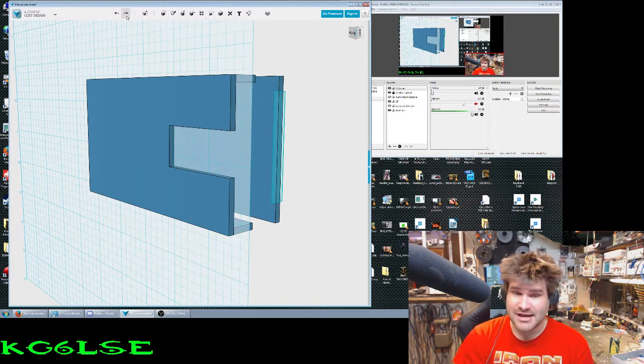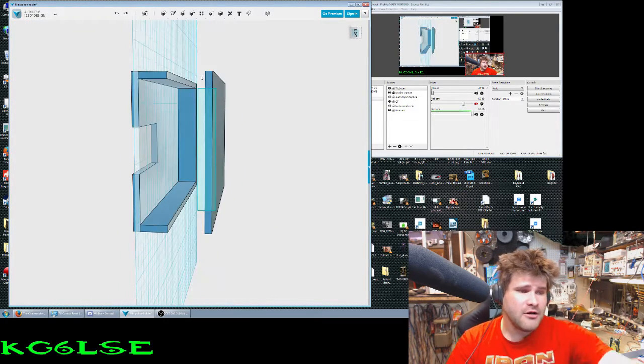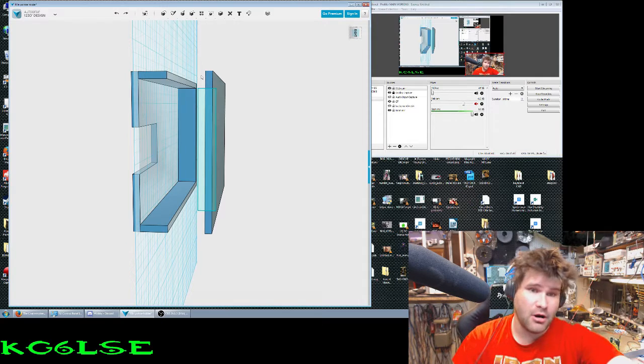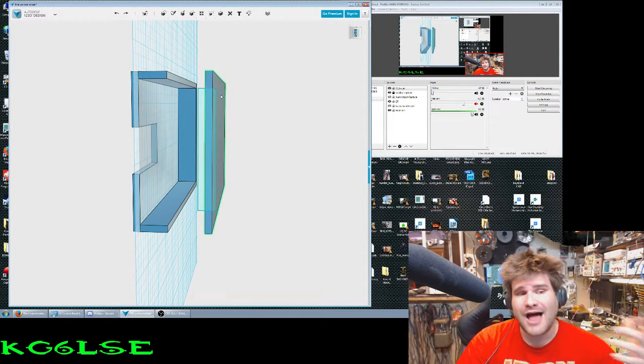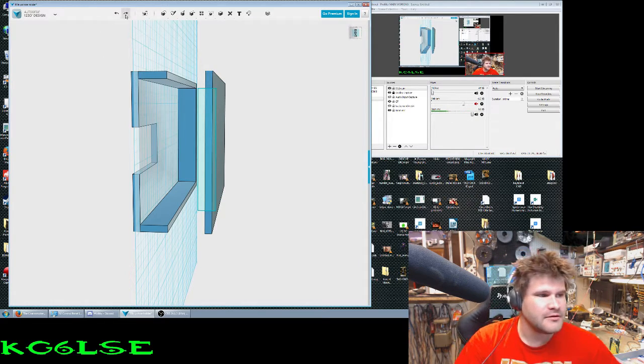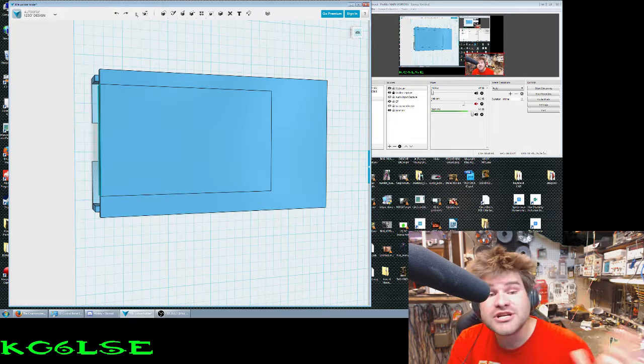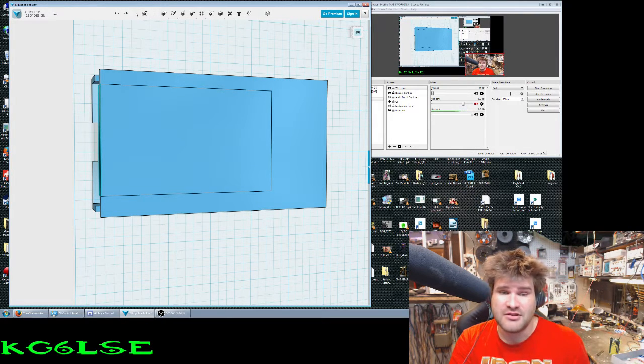And then at that point in time, you can use your calipers to figure out how big the screen's going to be. Again, make it a little wider than the print is thick for this one part in the print right here. This way it allows you to just bring the whole thing out. Just eat it out. Then you'll extrude to the size of your screen, but origin it to the top. Your screen might not be at the top, but origin it to the top, and it's still 2 discrete solids.